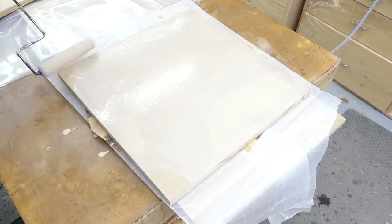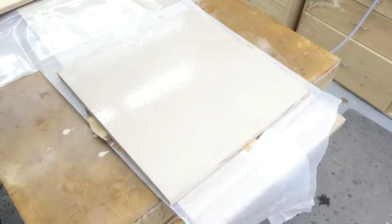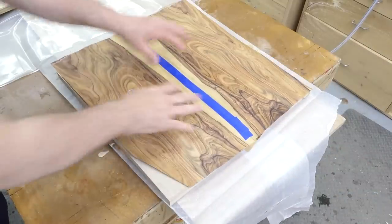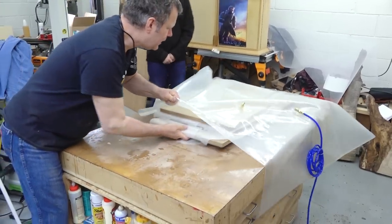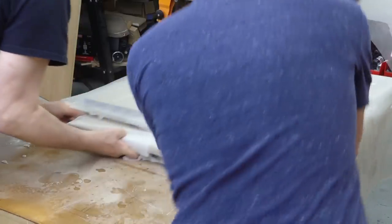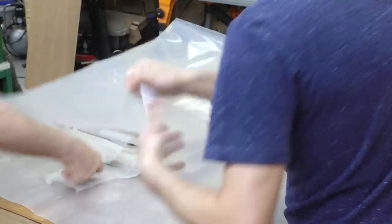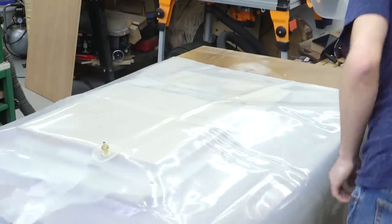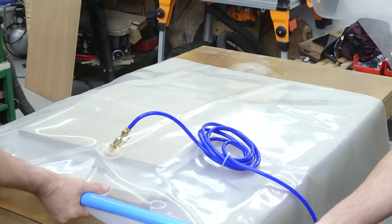The number one cause of veneer failure is glue glaze, meaning taking too much time putting the glue on and waiting and not getting in the press. And not enough glue. And then a second cause is too much glue. Too much glue will add too much moisture, and then the veneer will want to bubble and have to move, and it can't go anywhere.